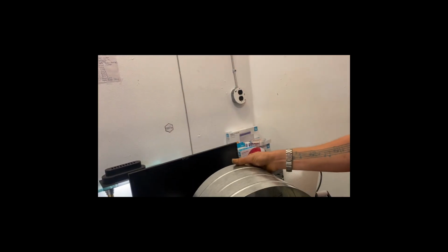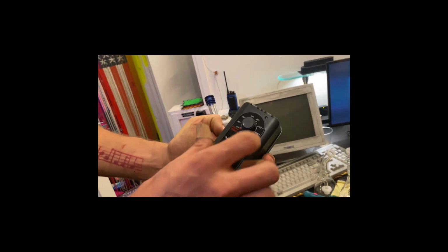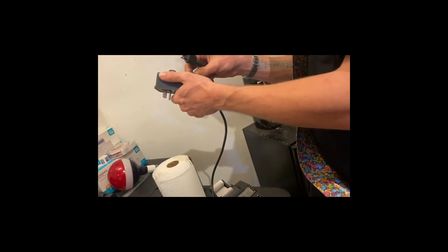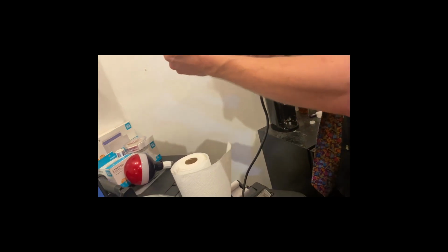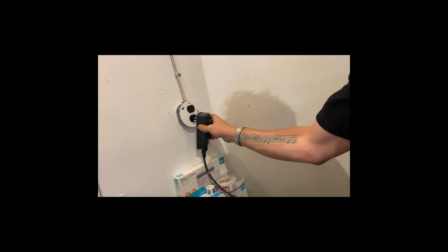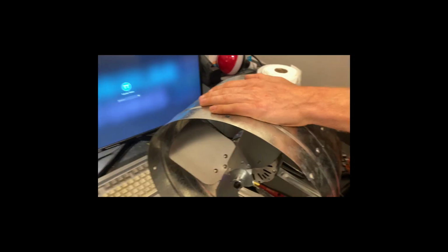The way these ones work, because you notice there's no thermostat like a normal gable fan, is they ship you the fan with this unit right here. So this plugs into the wall, and the fan plugs into this, and it's got a variable speed and a thermostat on it. It's external, not hardwired. I just think it's cool that you get an external plug-in thermostat and variable speed. And it has an on-off switch too.